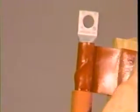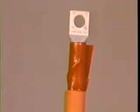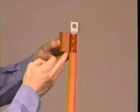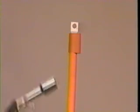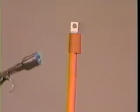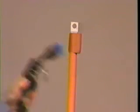Now, using light tension, wrap two layers of red sealant around the lug barrel. Place the shim tube over the red sealant butted against the end of the insulation. Set your torch pressure according to the manufacturer's instructions. Light the torch, making sure you have a 12-inch bushy flame. Shrink the shim into place.